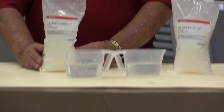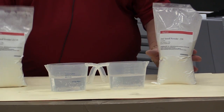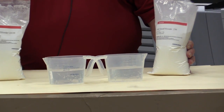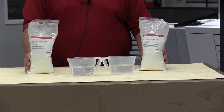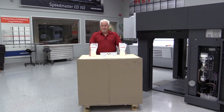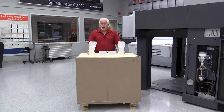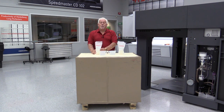Some manufacturers just have a C in front of their numbers and then it would have the number of the micron size. We have a powder that is also 23 micron but it is not coated. What's the difference? The difference between coated powder and uncoated powder is primarily for the application. We call this low dust because it keeps the environment around the press room much better. However, this powder is preferably used for one-sided printing.